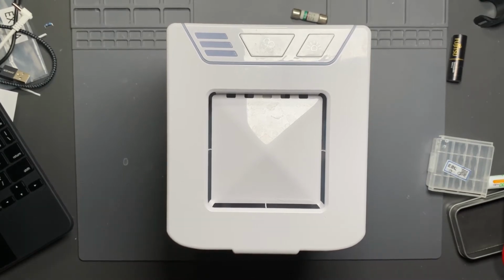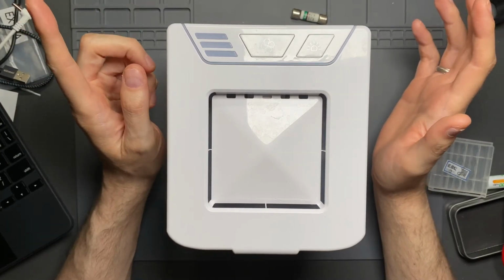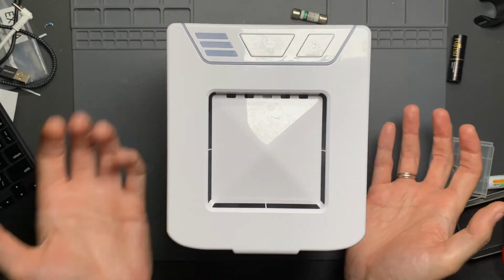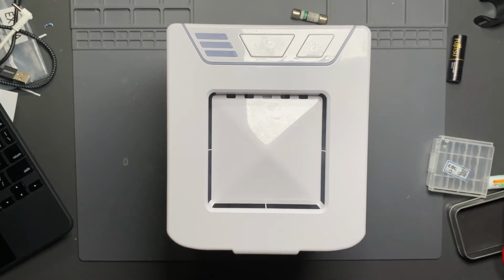In my testing, the longevity of these filters, although they claim long life and durability, they don't seem to work well at all in any sort of situation where you have hard water or softened water, and they seem to start to mold even though they say they don't. There are some filters in the really inexpensive coolers that will have the same shape as one of those cartridges and say that it has exotic materials in it to prevent mold and bacteria and all that stuff, but in reality it's just a very inexpensive paper.